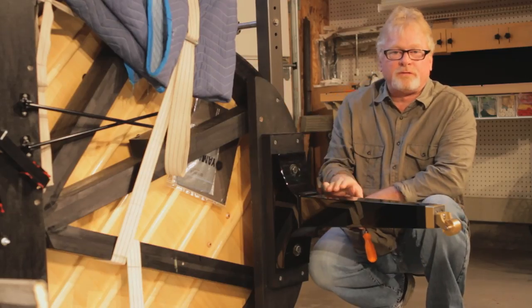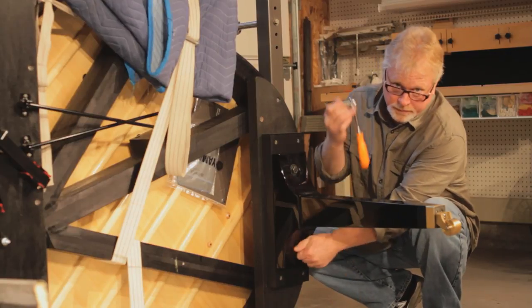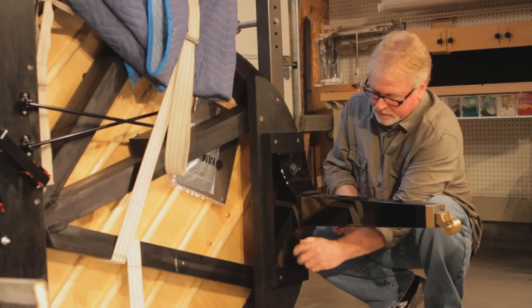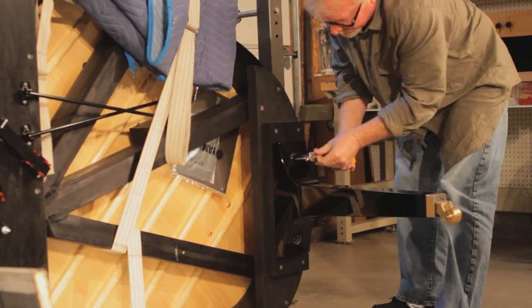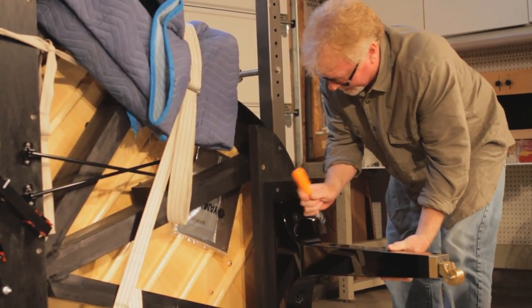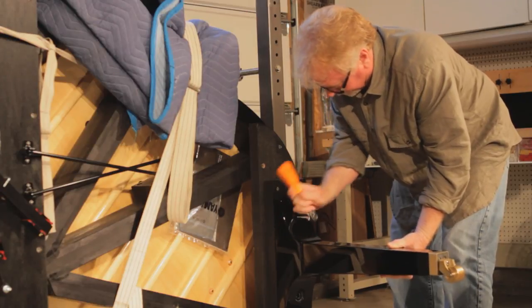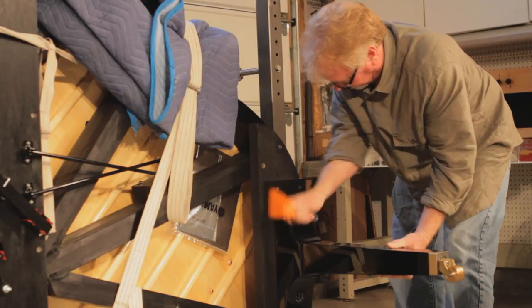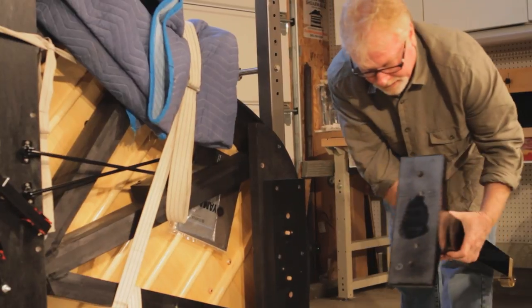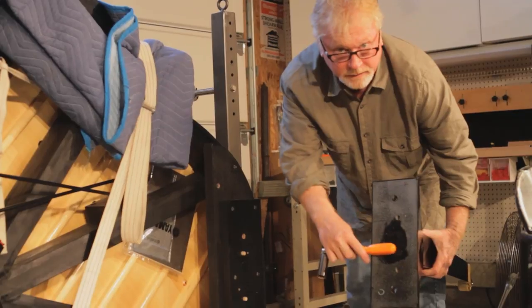This is a different configuration for a leg — this is a bolt-on, so you remove the bolts using a socket wrench. The bottom bolt I've already loosened, so you pull out the bolt, then you pull out the top bolt, and the leg is doweled in. You can see the dowels are on the piano and they go into the leg, so there is no leg lock on this piano.